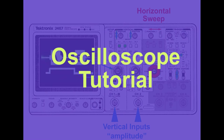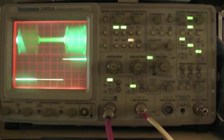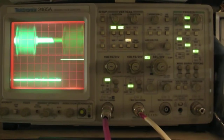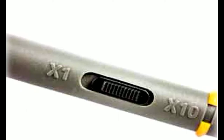An oscilloscope's view of the RF envelope is essential to understanding the integrity of the signal from tape. Oscilloscopes are like recording consoles and workstations — they all do the same thing, but not exactly in the same way. In lieu of having an experienced tech on hand to guide you through the process, here is a quick tutorial on the vertical amp. The RF envelope is connected to scope channel 1, and the head switching pulse is connected to scope channel 2. Adjust the height of the waveform via the controls labeled volts per division, and adjust the position of each waveform via the two pots at the top of the vertical amplifier. Note that the RF signal requires a short, low-capacitance cable, or a test probe set to times 10.